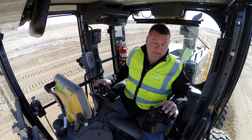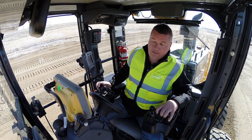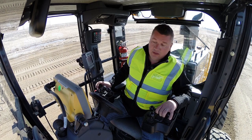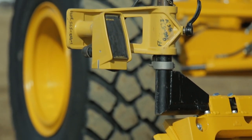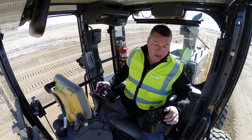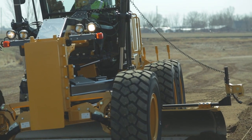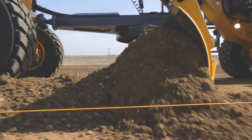Now with my GP functions in the machine from Deere, the buttons and everything are all integrated in place. I simply press and hold, I survey the elevation to the string line, I turn it into automatic, I turn the slope side into automatic, and as I crawl along the string line the grader is going to follow it, cutting it exactly where it needs to be.